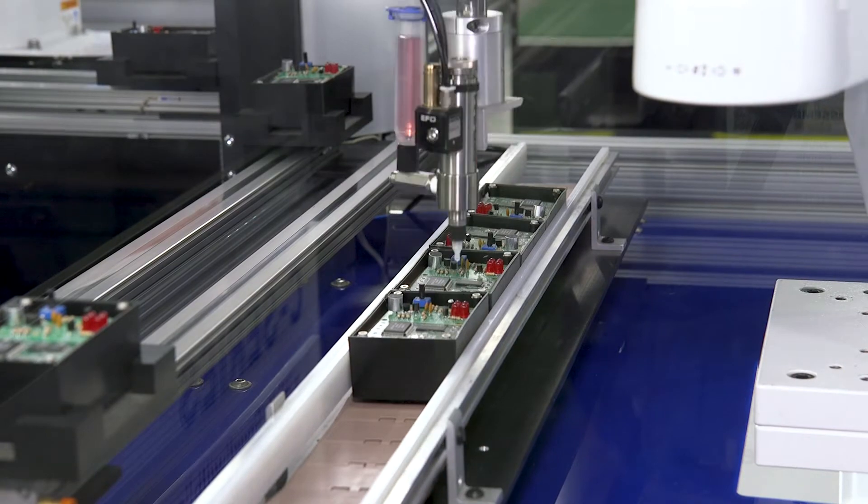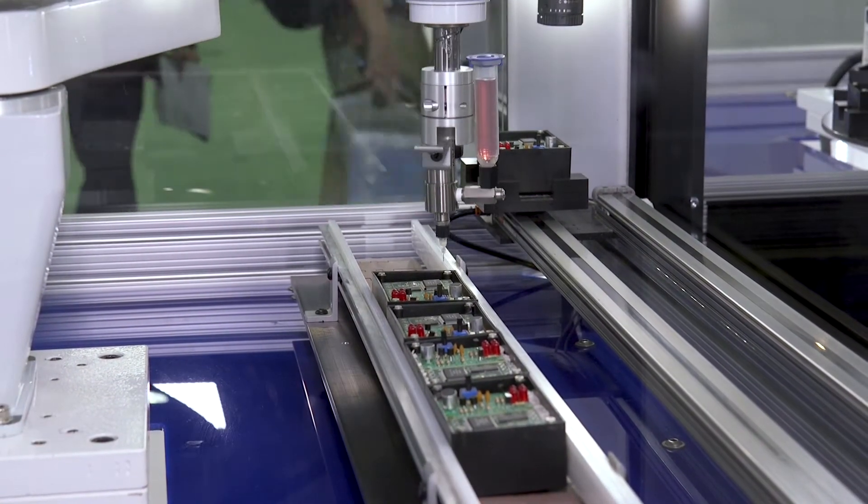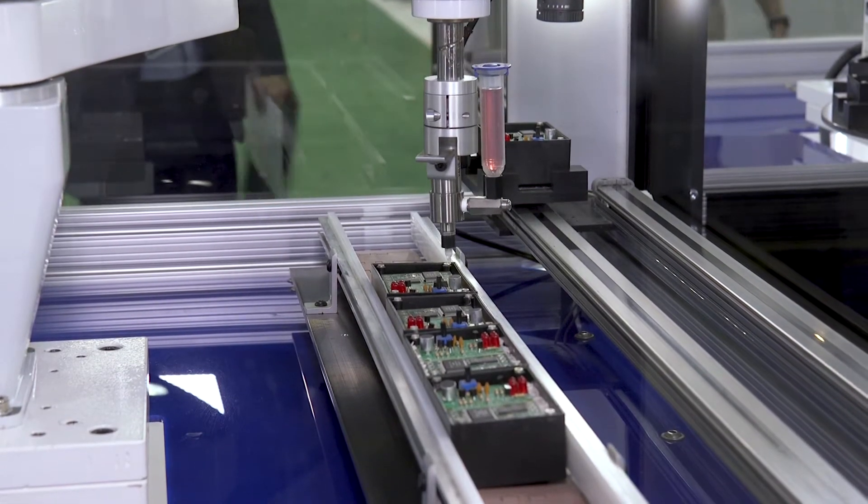This application is actually showing two components of Epson Robots. We're doing a dispensing and we're using vision to identify the locations on the circuit board where we're supposed to do the dispense. And then after we do the dispensing, we're doing an inspection. Something that's unique about our inspection is that we're checking for the consistency of the bead after it's been placed down.